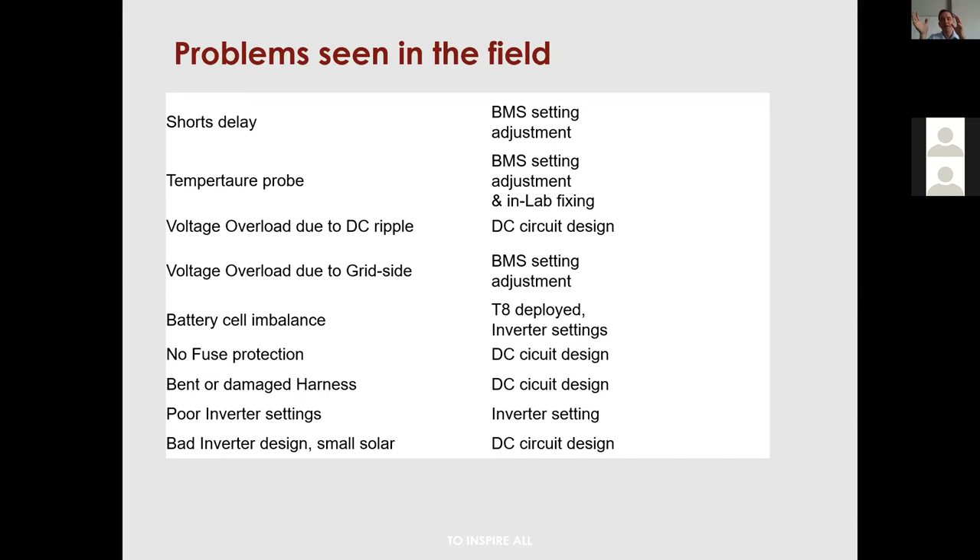The factory pairs batteries as two units with the closest-matched cells, so they will run together going forward. If you don't respect the pairing it's not catastrophic, but you should try to install the two batteries as close to each other as possible in terms of both overall voltage and internal voltage. Respect the pairing and you won't have cell imbalance issues.